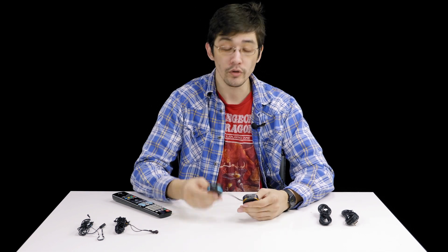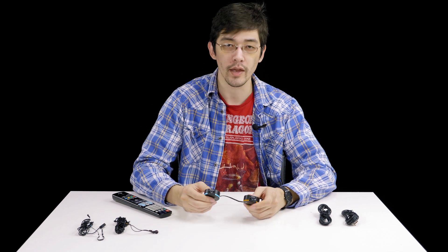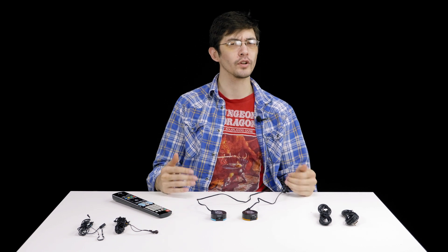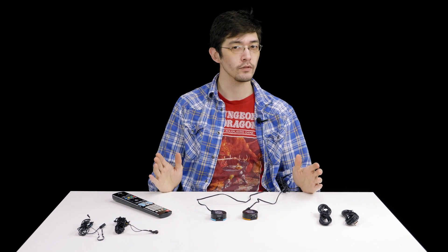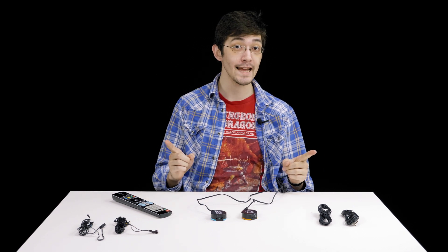If you find that when you trigger the receiver the emitter doesn't light up, the issue you're having is probably that there's either too much distance between the two or there's something interfering with the signal. So if you're shooting through concrete with rebar, or if you've got a heavy Wi-Fi signal — it's very unusual for a signal like that to interfere with this, and normally it works just fine even in an environment with lots of Wi-Fi — but that could interfere, so if that's the case try shutting your Wi-Fi off and testing it again.